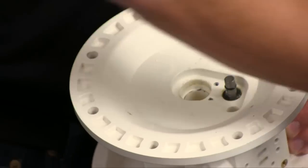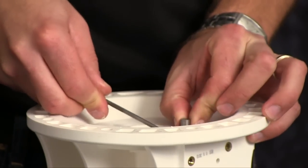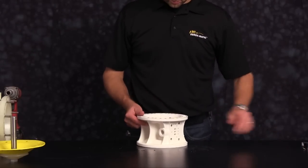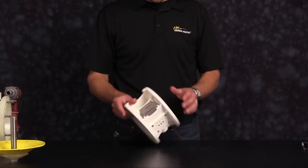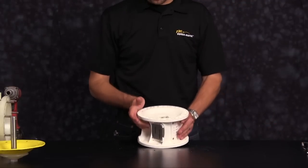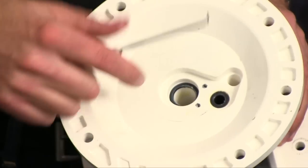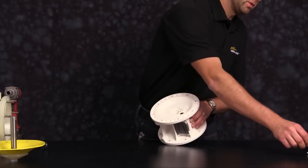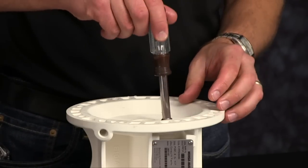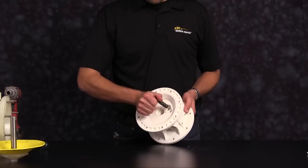Now remove the mainshaft o-ring. Now remove the bumper o-ring on one end of the pilot spool — this will allow us to remove the pilot spool from the pilot sleeve. Remove the pilot spool from the pilot sleeve and set aside. Now remove the second valve retainer plate and remove the main shaft o-ring. Now remove the pilot sleeve. This can be pressed out using a socket, nut driver, or any tool that won't damage the pilot sleeve or center section of the pump. Pull the pilot sleeve out from the opposite side.